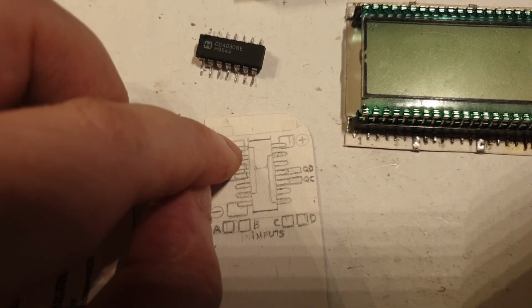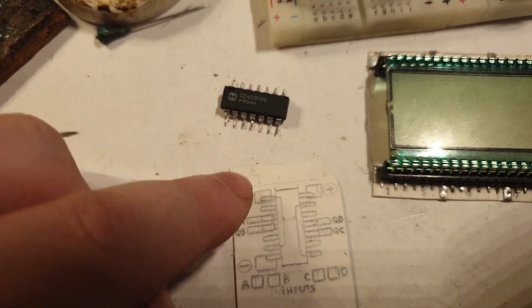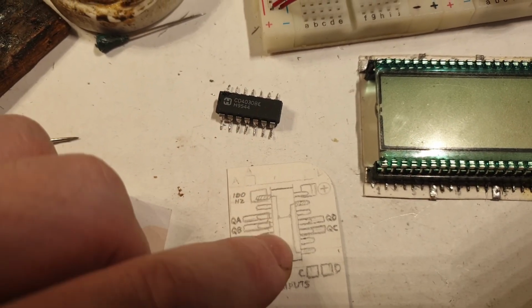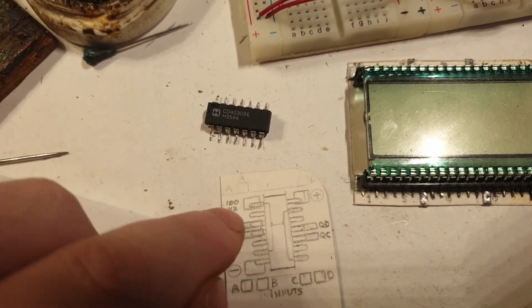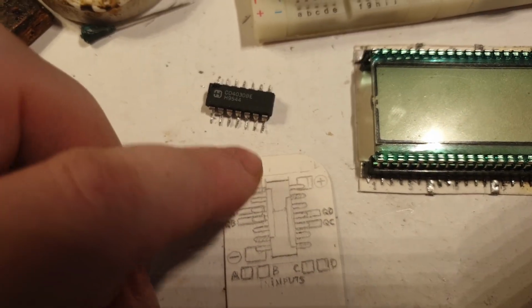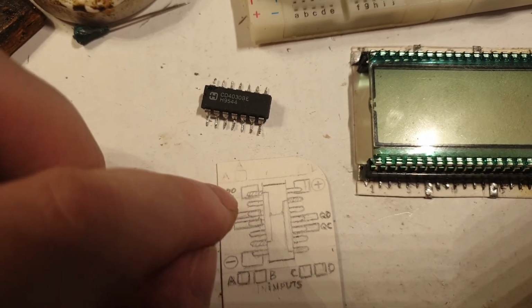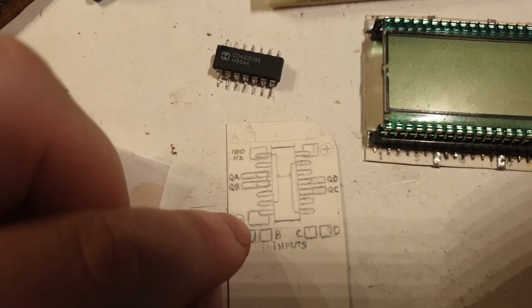So one wire will come to this pin from the clock. Another wire will go from the pin to this mesh that I'm having there, so it's two. And another wire will jump to other chips. Three wires on the same pin is not good. It will spring out the other two when I want to solder the third one. So it's better to have a bigger pad like I'm having there. It's big enough, probably a little bit bigger, most probably.